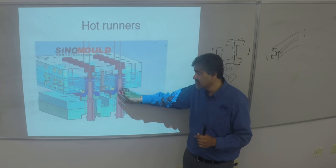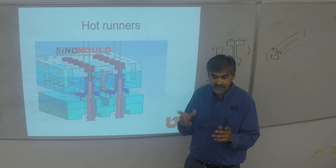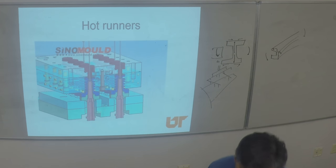You don't have to CAD every single detail on the tool itself. The inserts, ejectors, and base plates are like pulling a screw design from CAD — there are already CAD models that exist. If you do this professionally, you'd spend very little time on the actual male-female cavities. Once your part design is ready, it's a matter of quickly assembling the rest from known library components.